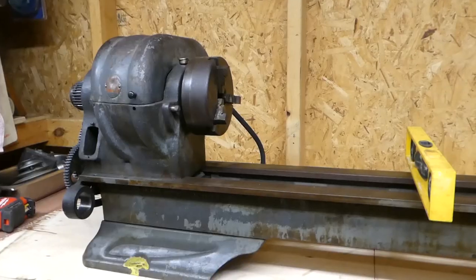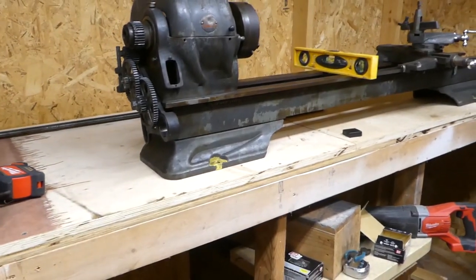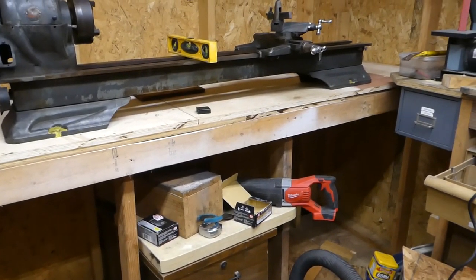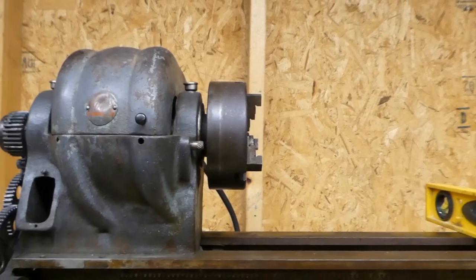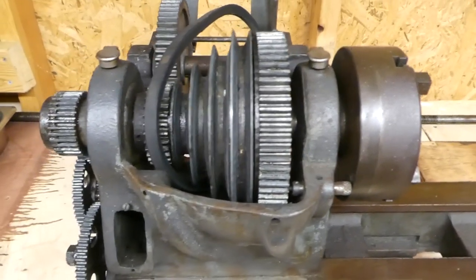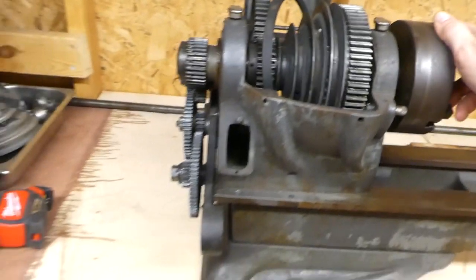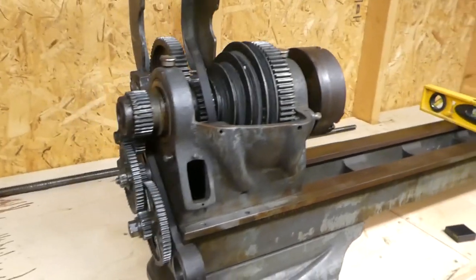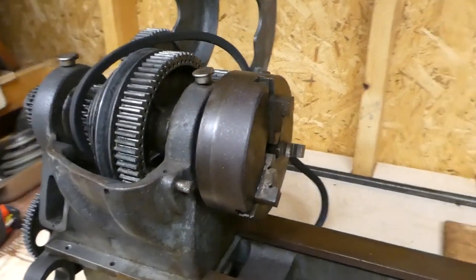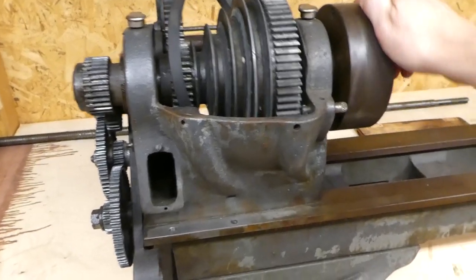That's going to be nice on my back. As far as cleaning, I haven't done much more than what I showed in the pictures, because I got started on the bench. I realized very quickly that I needed more space in the shop to spread out and clean parts, and so that necessitated a complete shop reorganization before I started cleaning the lathe. The chuck is very much stuck on there — I've tried a couple different ways to get it off and it is not moving. I think I'm going to use left-hand threaded rod to thread through and use it as a counter to the rotation. I was watching Mr. Pete's video and that's one of the recommendations he had, although he said he's never really had one that stuck. If anybody has other suggestions — I'm obviously not going to use the back gears to do something stupid like that — but I do need something to hold the spindle pretty tightly.